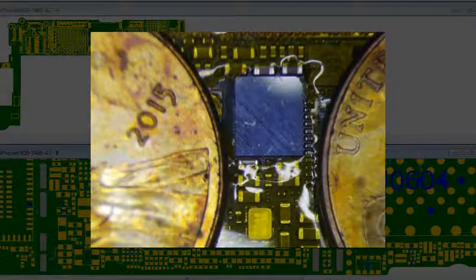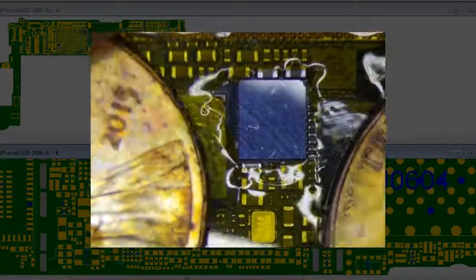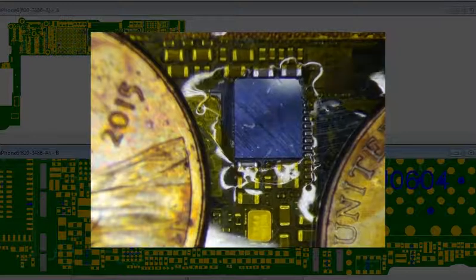The touch does not work sometimes, and since we're not getting any gray bars, I'm going to do Cumulus first — that's what I normally do. The only difference really is the PMIC looks like it's pretty close here.